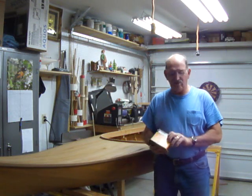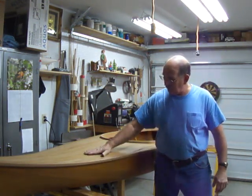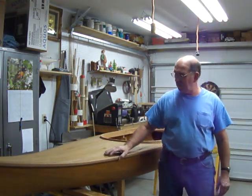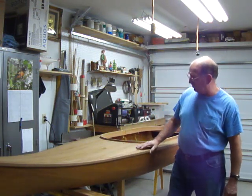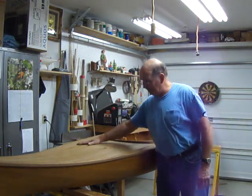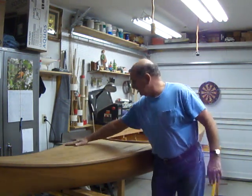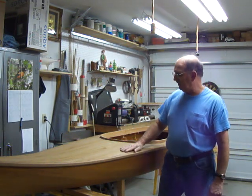Actually, I think these are inch-and-a-half staples. I'm going to glass over this, so everything seems to be holding well. I've got to putty all the places I stapled it — I stapled it every few inches along the side. Some people wouldn't like that, but the boat's side when I built it has nothing but staple holes, and this has some staple holes across the top too.